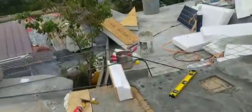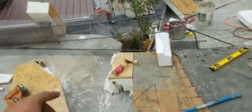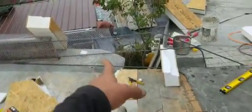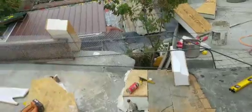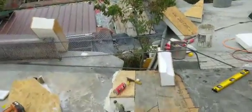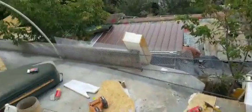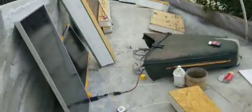This is what I ended up going with for the rebar anchor on this side. I got one rebar down that goes the whole length of that. Basically, it's this point right here that I wanted to address for tension, for pressure pulling apart right there. So there's one length that spans it, and then to get the width across it, that's what the next two are for. At the point of greatest need of reinforcement, there will be a 16 to 18 inch bond beam with three pieces of rebar. And over here, it anchors in multiple different places into this remesh and this plane and everything. So it will be able to bear a lot of lateral force, and that's partly what this is doing, structurally reinforcing all of this so that it stays integral.